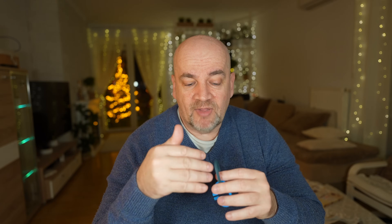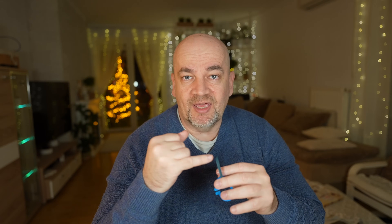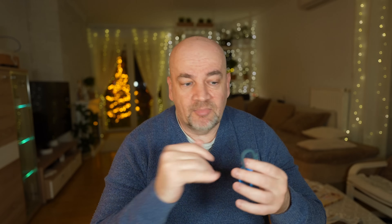For the end, I'm really impressed with the stiffness of this Rigidex. It resists great to bending and creeping, and also has great temperature resistancy, so with these properties it is very close to ABS for example. But I think the weakest point of this material is the price. But for those who don't have an enclosed printer, this may be very valuable because it is printable on open-style printers too.